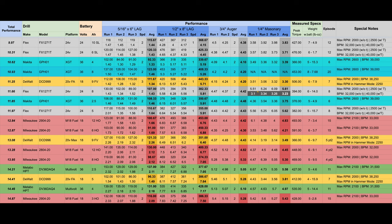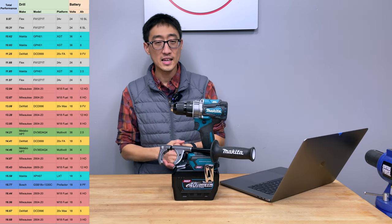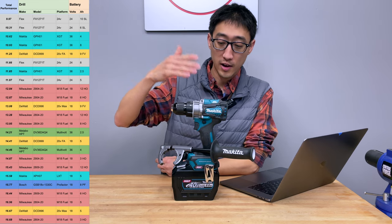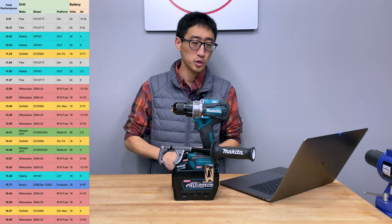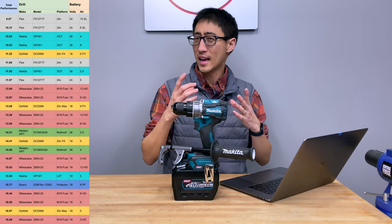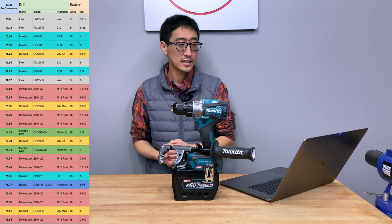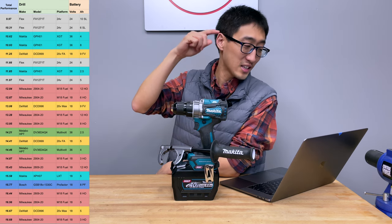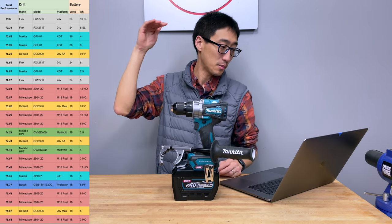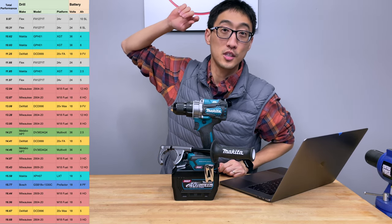The key takeaway is you did not get as much performance improvement with the 8 amp hour as you might have expected. Does the 8 amp hour big-boy battery provide more peak power on this tool? Most likely not. And that seems to generally be the case with most Makita XGT tools — they've been designed and tuned to depend less heavily on battery amperage to provide consistent performance. The leaderboard currently goes Flex, Flex, Makita, Makita, DeWalt, Flex, Makita, Flex, Milwaukee. Hope this video helped — have a great day, get back to work, and we'll see you next time.